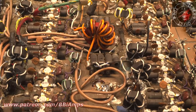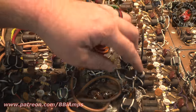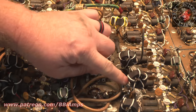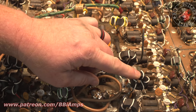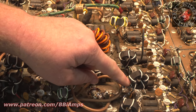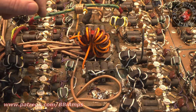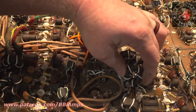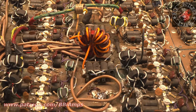And then on top of that, our toroids are flopping around. Look at this. If this toroid makes contact with this portion of the conductor, it now energizes this toroid with the RF. And last time I checked, that's no good. This piece of ferrite has to float insulated above this connection. Everywhere I look, there's shit like this. Everywhere.